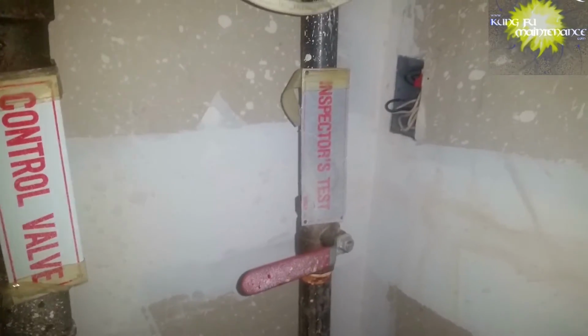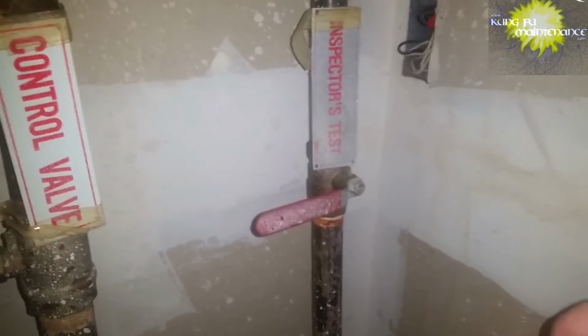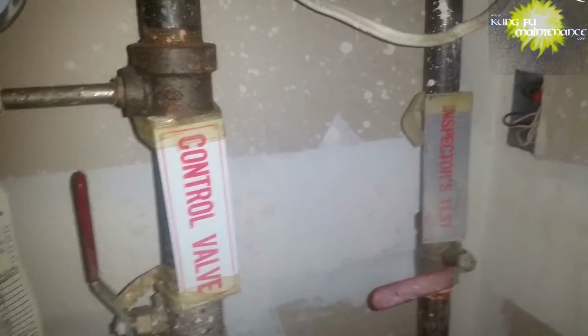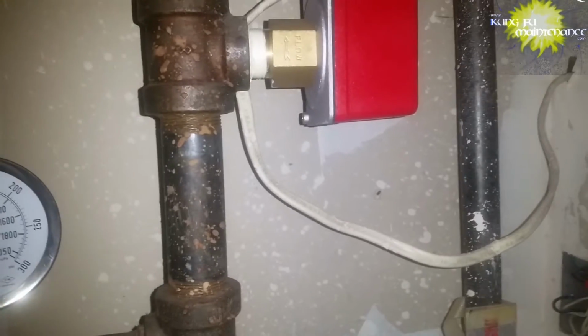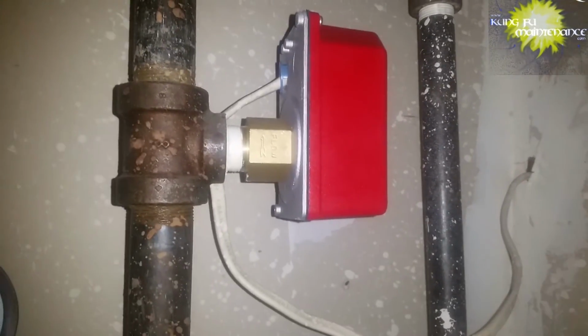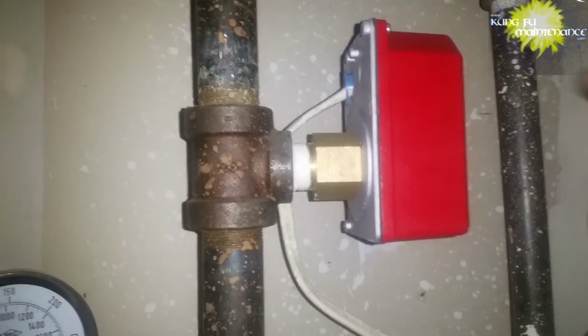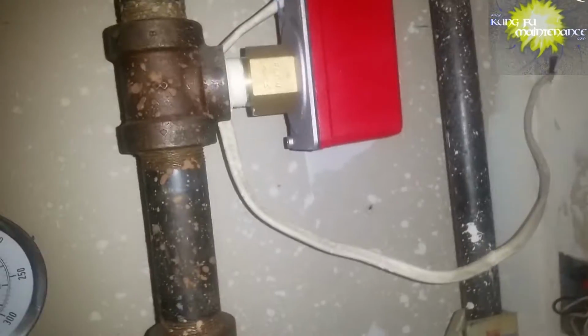And what it does, it does a number of things. It's verifying that everything sounds properly, that the alarm goes off when it should. But the other side of it is it flushes out the water and debris to make sure there's not a clog or something that would prevent anything from putting out a fire in the event that you had a fire. But also, if something happened and it went off, then the water coming out of there wouldn't be so smelly and bad, because it sits in the pipes, is stagnant, and does become a little bit corrosive, but it absorbs a lot of the smells and everything else. And if you had a fire, you kind of want cleaner water to deal with the fire and put it out and save life, but also minimize some property damage and minimize the smells and everything that you have to deal with after a horrible situation anyway.